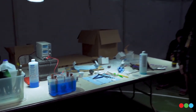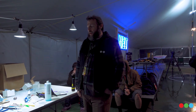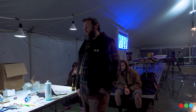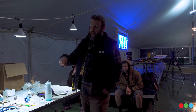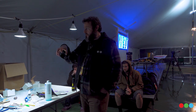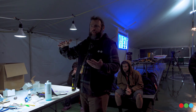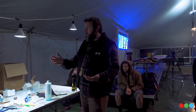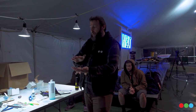I will also say, to epoxy plastic to plastic can be complicated because bonding plastics is a tricky deal. So I used a two-part epoxy, and before I did it, I took a razor knife and did some cross-hatching on the Tupperware to give a surface to grab to. I did the same on the bottom of the marble stand, so it wasn't two glossy surfaces trying to epoxy together, because I have had them pop off before, and then I learned to put a lot of surface texture on there before epoxying them.